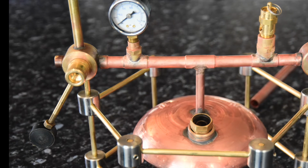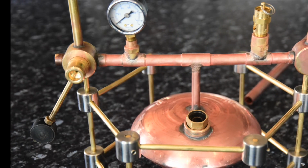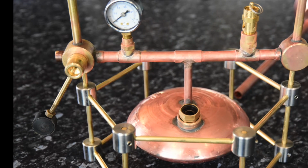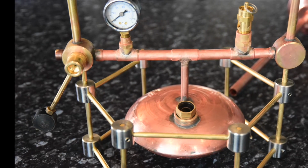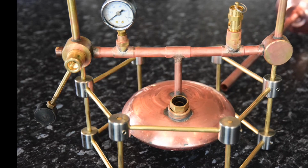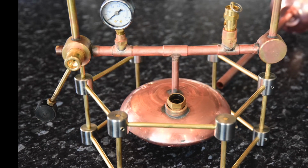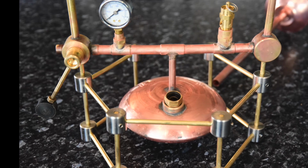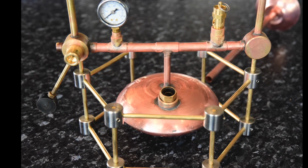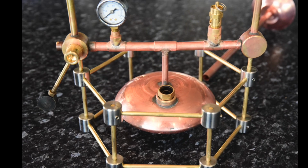When you're doing this kind of testing, it's a good idea to fill the tank with water first and then just add a little bit of compressed air to give the pressure you want. That way, if it ruptures and bursts, there's not a lot of expansion because water's non-compressible, and it would just pop open without causing a major explosion, whereas air inside under high pressure could blow it wide apart and throw bits of metal at you.